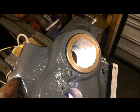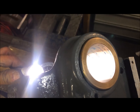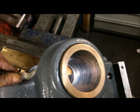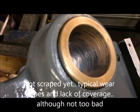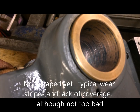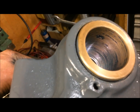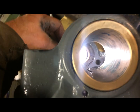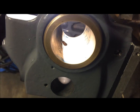I'll just try to use this one first — rub on the second spindle and headstock. We can see how the unscraped area has plenty of blue coverage, but it's not spotted the same way — it's blotchy and quite uneven. Even continuing to scrape the blue spots reveals this unevenness.